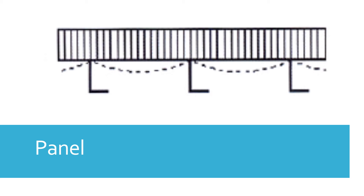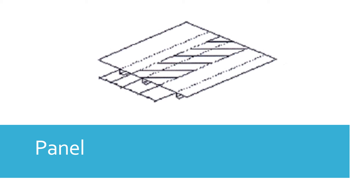The thickness of the plating is determined by the stiffener spacing. In bulkheads, therefore, the lower plates are thicker than the upper plates. Classification societies provide regulations for the maximum spacing of stiffeners depending on their function. Each stiffener takes its part of the total force working on a panel; the magnitude of the force is related to the pressure on the panel, the spacing of the stiffeners, and the unsupported length of the stiffener.